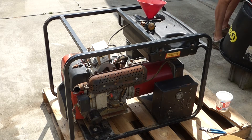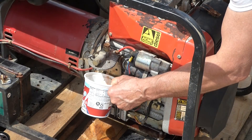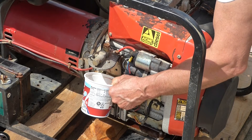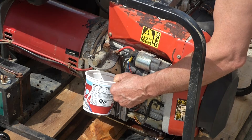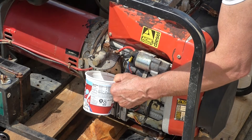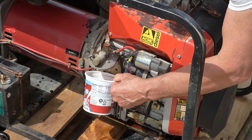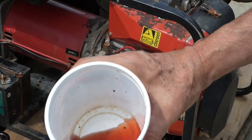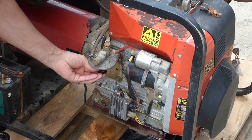She's dry in there, no doubt about it. That ought to be enough to give her a good test. There's debris in there too, but it's good — we're pumping this out. That's a good sign that it's pumping; that means the pump's not all dried out. I'm getting fresh fuel now — you can see the debris that's in there. I'm going to go ahead and put the new fuel filter on.